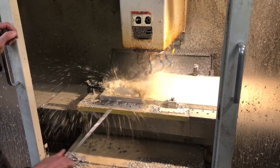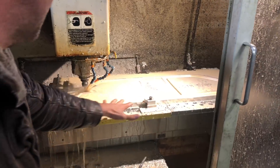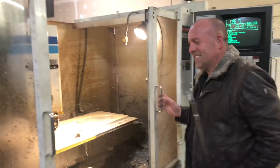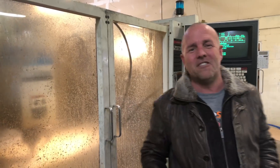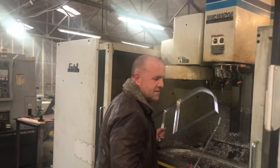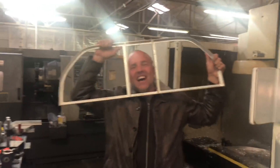This is my favorite part - turning 68 pounds of 6061 aluminum into a frame of a panel. You can see over there in the back, this whole slab moves around, the cutter just stays in one spot. This is turning aluminum into a pile of chips and ending up with a two and a quarter pound frame for the Wilga. That's a happy picture frame.